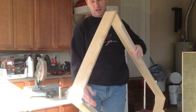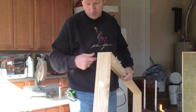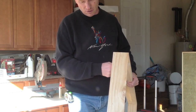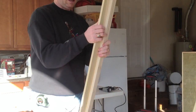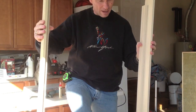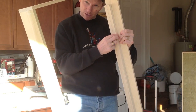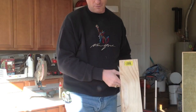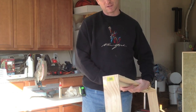This is what it looks like when it's done. All I did was staple it — some people use screws, but three staples in each side hold very well. I tried to tear one apart and it's tough to get apart. You'll notice how the cleats work: the cleat is flush on one side and leaves an exact two-inch gap, so when you lay the insulation in, it gives you an inch-and-a-half barrier between the wall and the actual insulation.